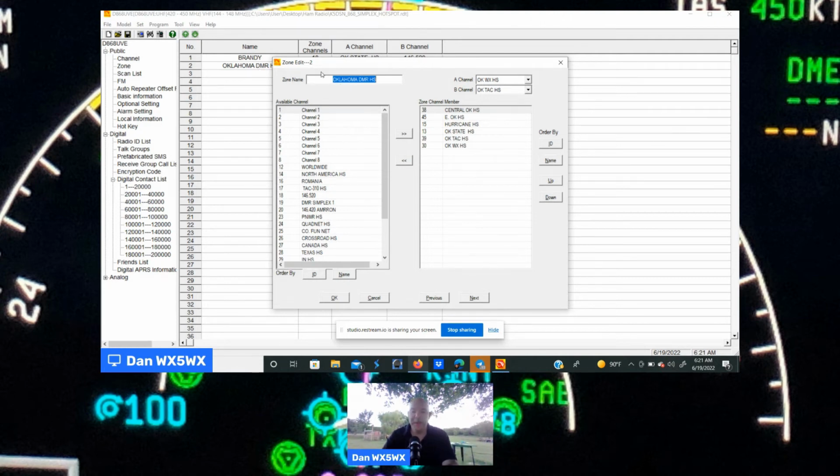That's up to you. But basically, what you would do is select the zone, name it, and then bring over the channels that you programmed. You should see them over here on the left side, and you're going to bring them over here to the right side. Now, Anytone's beautiful because Anytone allows you to order by the name, ID, whatnot. Some radio manufacturers do not allow you to do that. It's just by whatever is in the list, and you have to move it around manually. This makes it great because I can arrange everything in alphabetical order or by ID, whichever I prefer. So basically, with this software, I would click over here like 446575 and then choose that one, or I can just click on it again if I don't want it and take it back over here to the left.